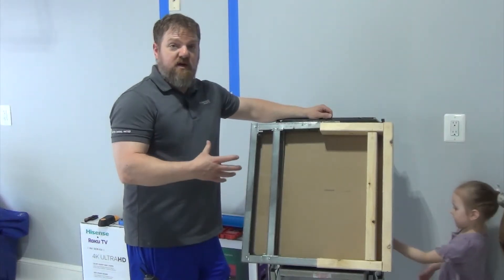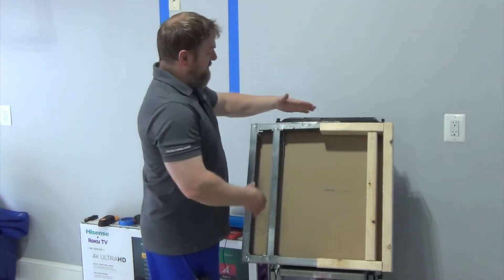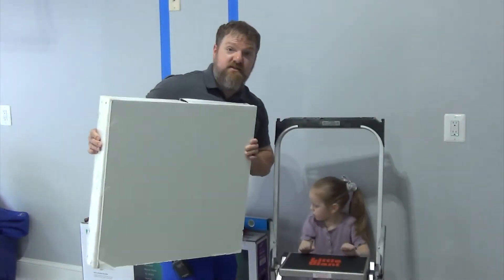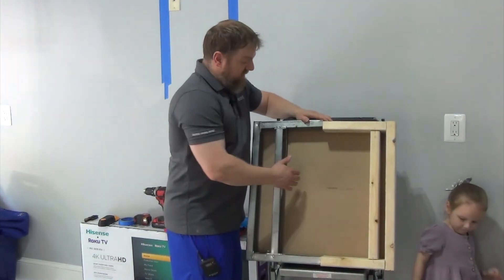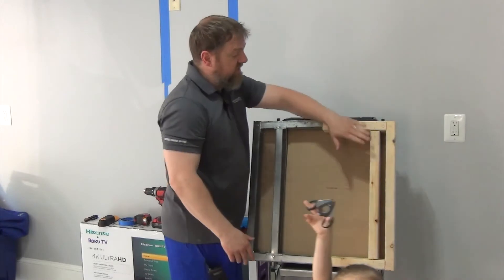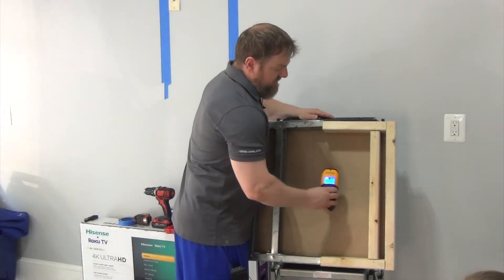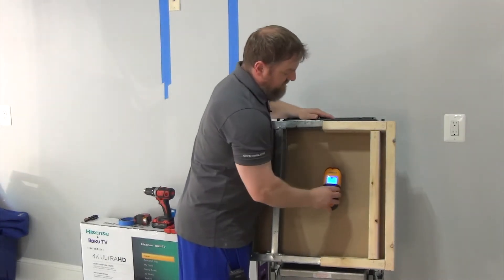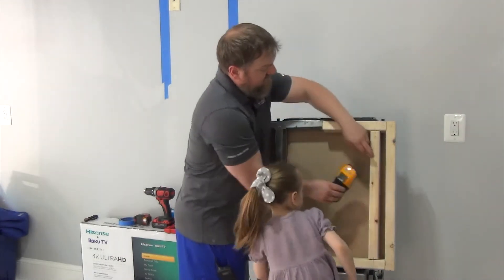This is actually a sample wall I built for another video, and this is what the wall looks like from behind. You know, this is the drywall — that's a painted surface on the outside. If you were to flip it around, you have studs, and the studs are what you attach the drywall to. This one has metal studs on one side and wooden studs on the other — that's for a different video. So when you are on the outside of the drywall trying to find your stud, the finder is going to beep and say that's the center of our stud.